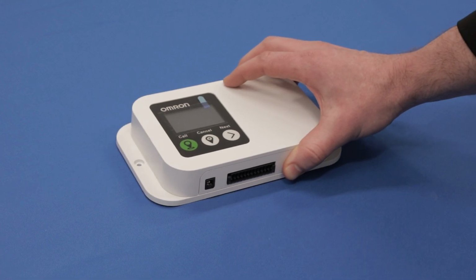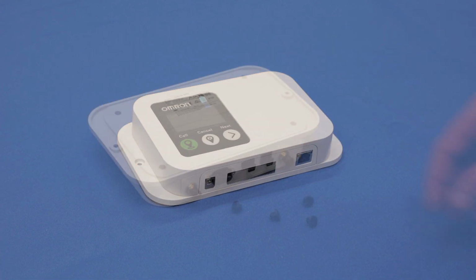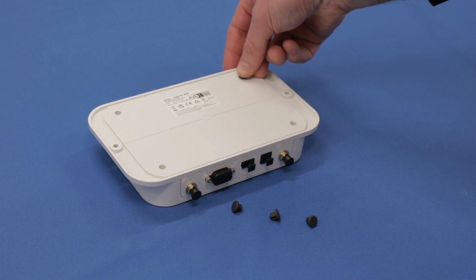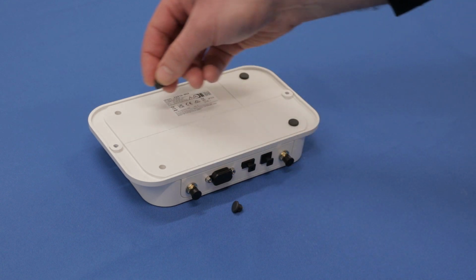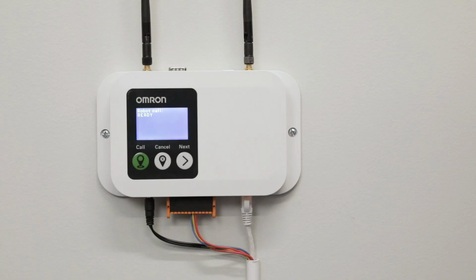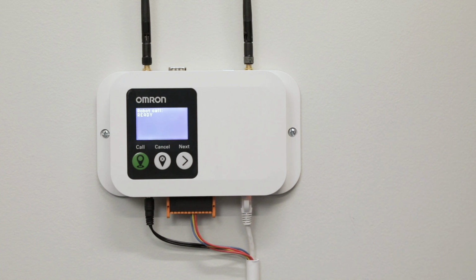The mobile I/O box can be placed on a horizontal flat surface without fixation. Mount the 4 rubber feet by pressing them inside the holes at the back side of the mobile I/O box. If mounting on a wall, fasten the mobile I/O box directly to the mounting surface using M4 or number 8 screws. Screws are not included in the package.